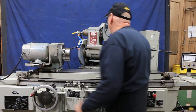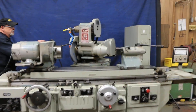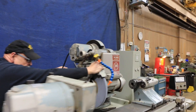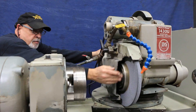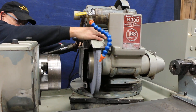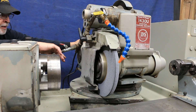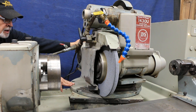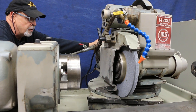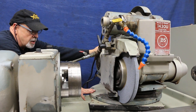You also have the top slide here, which I also loosened up. This intermediate plate here - you see it has holes in four different spots. That's so you can put a bar in there, and this plate can actually be spun. It's eccentric.